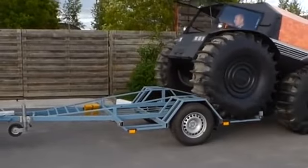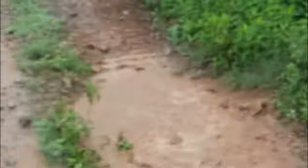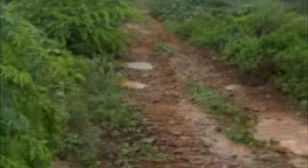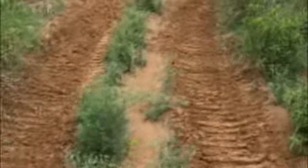When it comes to driving the Sherp N1200, the revs are locked at 2500 rpm, and it takes a little time to get used to steering this big ATV with levers — but the learning curve is not that steep. On land it can do a top speed of 40 km/h, and on water it moves at 6 km/h. The wheels are moved by chains submerged in oil, lubricated at all times and requiring no maintenance. You're so used to having a steering wheel, so that's something I had to recalibrate.